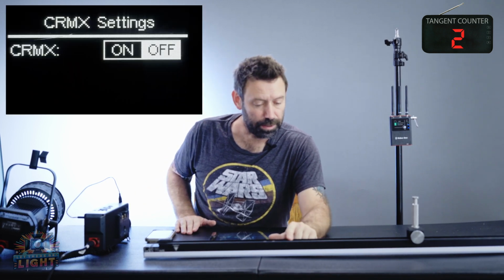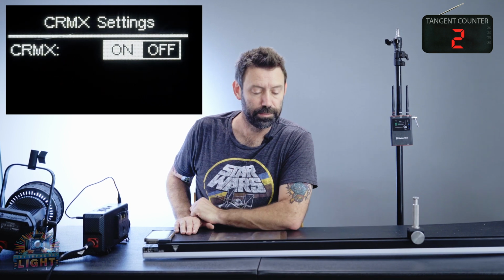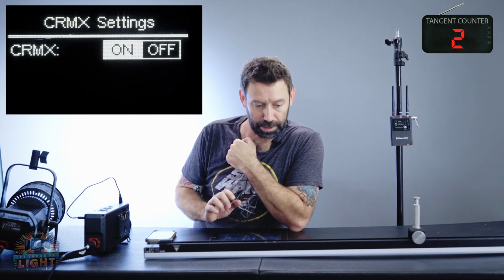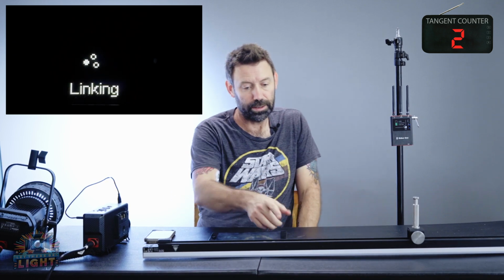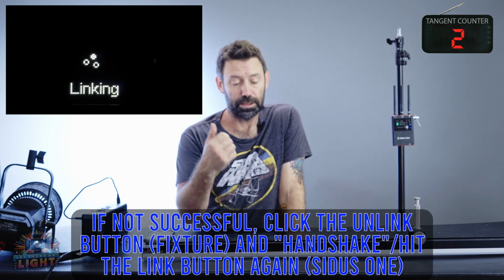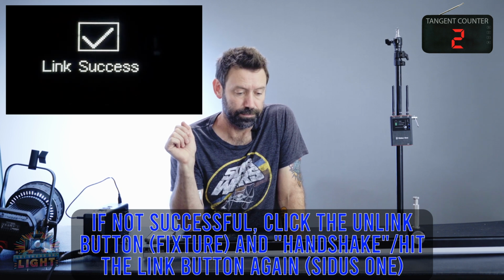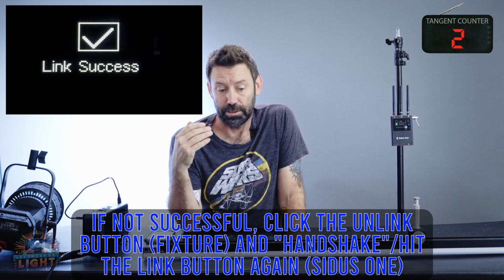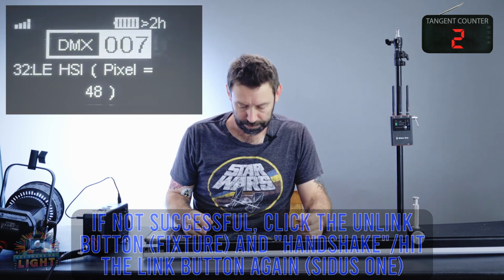So on the InfiniBar, we went to the CRMX menu. Let's just turn it on. Let's go ahead and hit the link button. This time, let's do it on the box. Again, it should be the same thing. So it's talking, CRMX is on. Okay, the linking screen comes up because now it's seeing a handshake. Link success, which is the norm. All right, now let's get into addressing the fixtures.